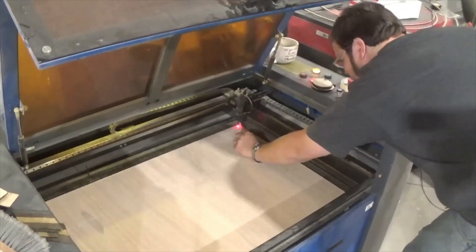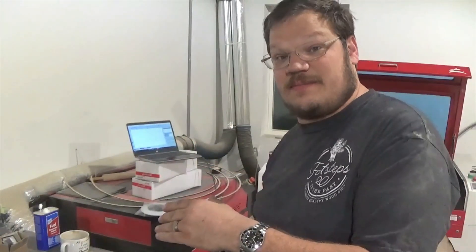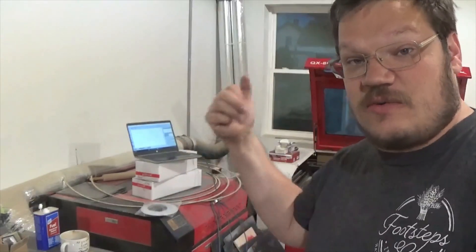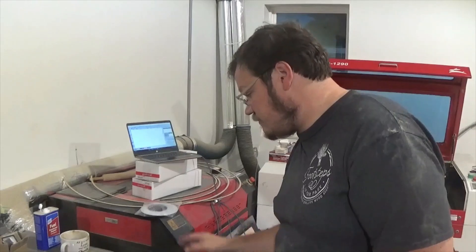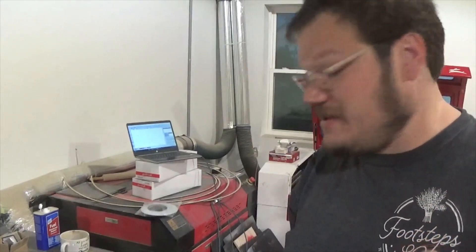For those of you that don't know, this machine has a built-in exhaust fan. I don't care for it — it doesn't work very well, and that's what's rattling in the back of my door. We'll probably show you a video on how to remove that and add an external fan. The bearings sound like they're going out, so I had to add an external one with a push button. Now the settings are where they need to be: 17mm and 65% power. We're cutting.